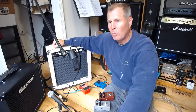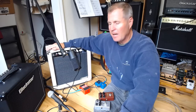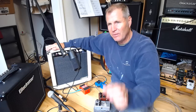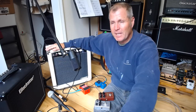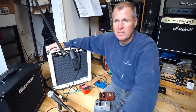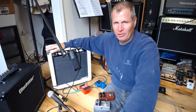Plus, the PC board in here is something I think I could fix, whereas in the Blackstar, it's got a lot of integrated circuits and ASICs, or application-specific ICs, those real tiny ones with a lot of legs that you wouldn't be able to replace. Surface mount type stuff, small. Whereas this is more discrete components, simple, and yet sounds great, takes pedals like a champ, rings out.